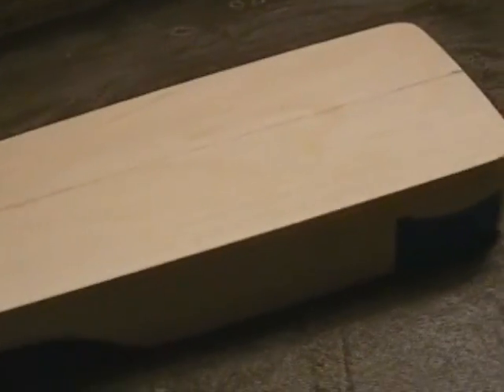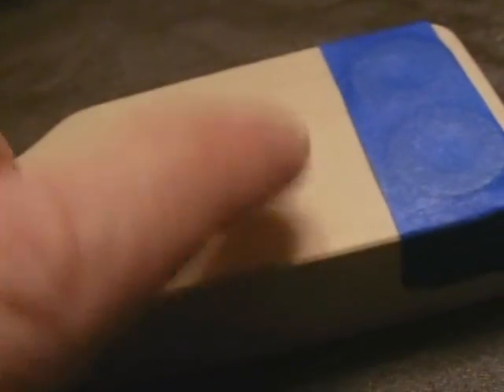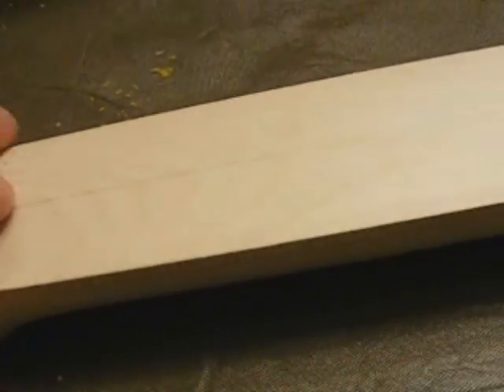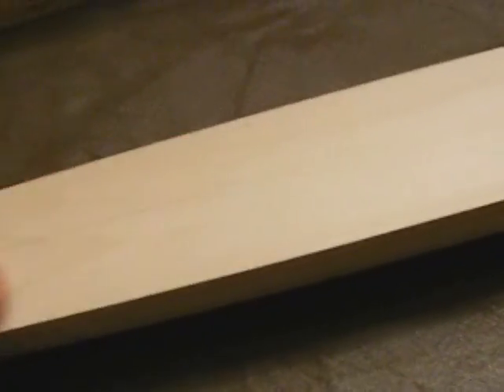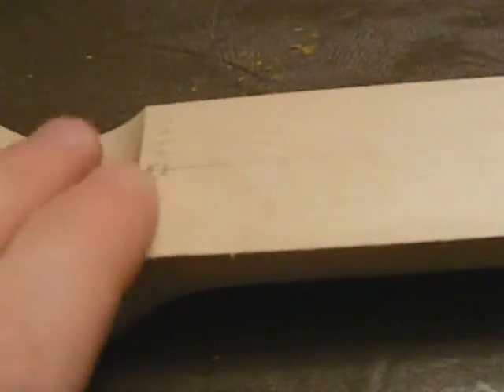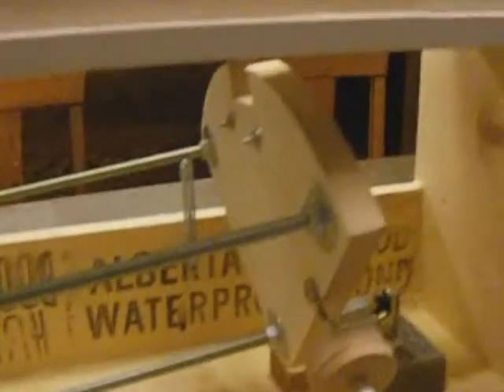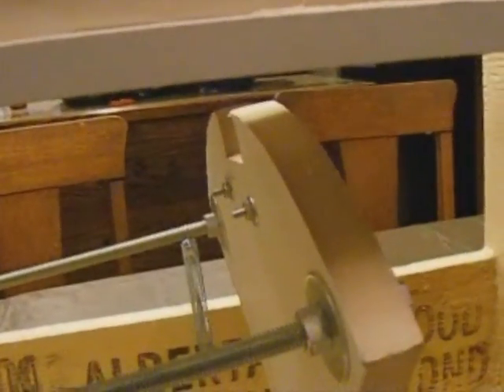Once I get to doing the body I'll do the inserts — I'll be using inserts for these next. Now, you see this blue tape with two washers. I needed that to bring my heel end and my nut end perfectly parallel to the base for the router, so that I wasn't creating a back ramp or any kind of ramping in the neck. The nice thing with this jig is I can introduce a little bit of a rake to the neck if I wanted to — that way I wouldn't have to shim the heel like a lot of guys talk about. I'd just put it into the neck itself and be done with it. I haven't tried it — whether it would make a big difference, I don't know.